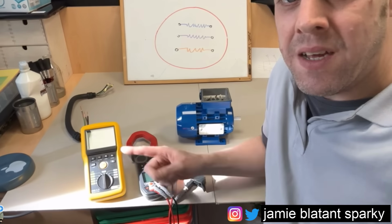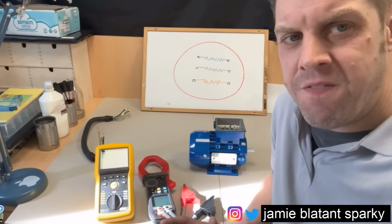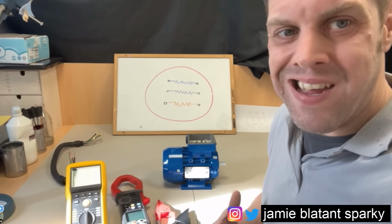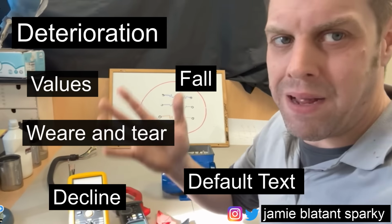So that's why I've now gone on to a giga ohm reading ohmmeter, which is basically the lowest level you want for professionally fault finding motors. But if you've got a mega ohm meter, that's going to be fine for fault finding. You don't need a giga ohm meter. Mega ohms will be fine for proving a problem because there's something there to find that's easy. You're in that window already. This is when you want to check motors and log their condition, basically.